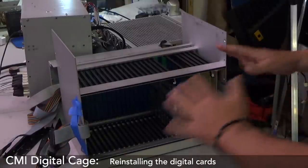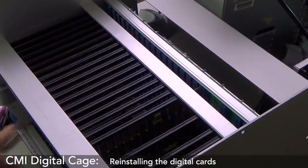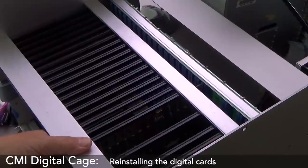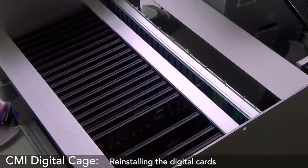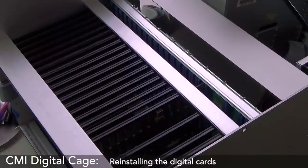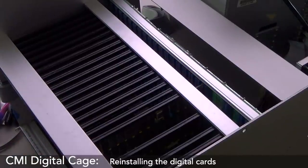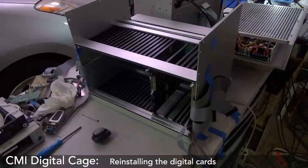And this is great because I've got an open chassis. I can really get on it. So when I'm pulling this board out, it is pulling the entire chassis along with it. It's sliding really easily, and the rails are not causing a problem at all. Clearly, it's not the rails. It's the edge connectors. Look at that. All right, this is obviously a problem. Okay, I honestly don't know what to do. Once these boards go in, they are in. Like Flynn.